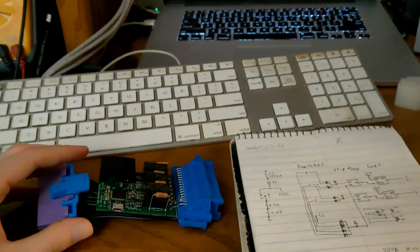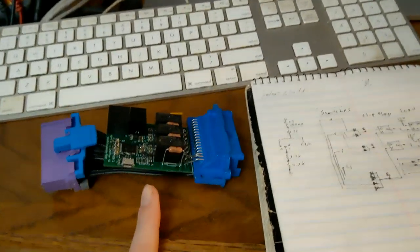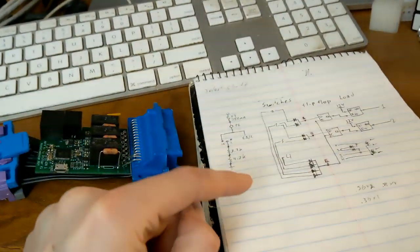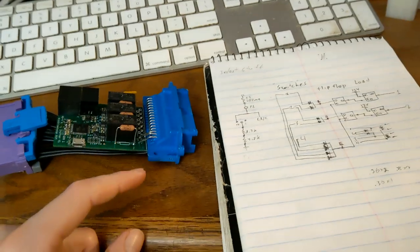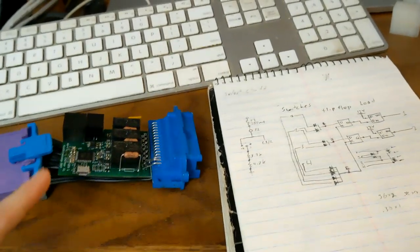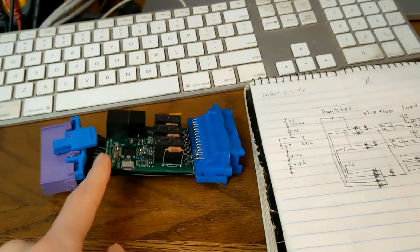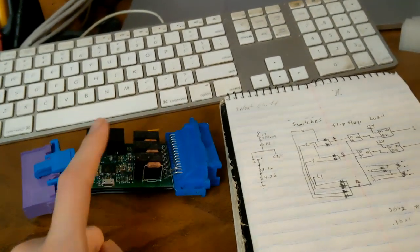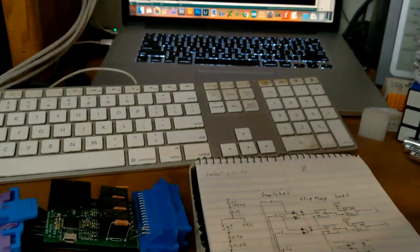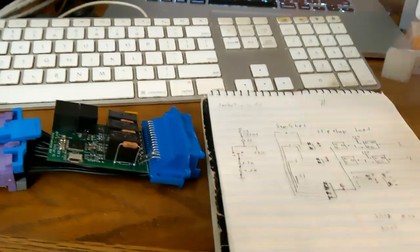But that's the Junior. With a Junior, we'd also have a Pro mode — the Nifty Shifter Pro, basically like version one. I might be able to build the vehicle shifter and power/comfort switch functionality into the Pro mode. If I can figure out the speed sensor trickery for OBD2, the Pro version would be able to do that and keep your check engine light off. You can get sequential — up-shift, down-shift — and have smart modes using the data to your advantage.